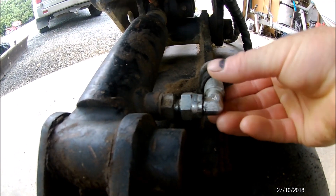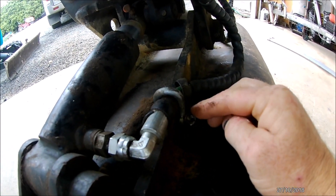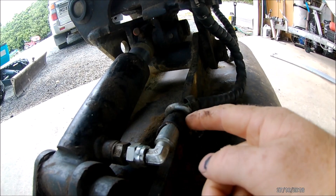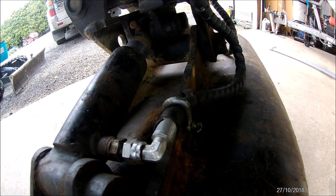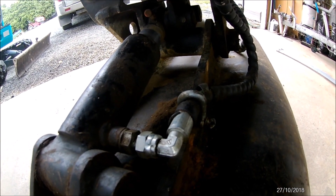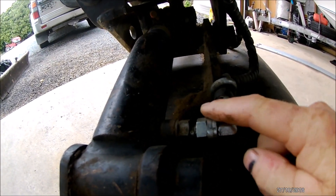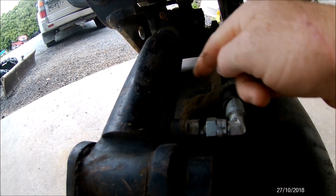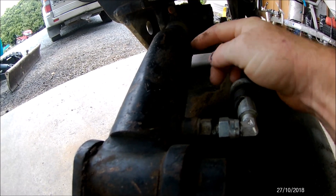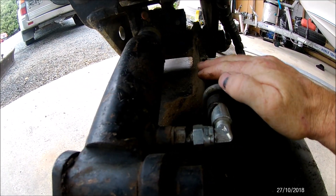So I need to make some sort of bracket that slides over this to protect it. I had these D-shackles through the flange here and that worked okay, but the hose ends up getting torn up and it's just a bit of a pain really. So I may look at some stage trying to reroute this pipe, possibly with a steel pipe, and bring it in here and then have a short elbow — because obviously when this bucket tilts up, this flange here pulls in into this groove.